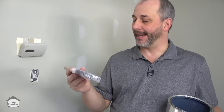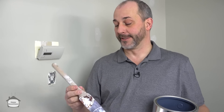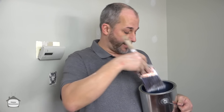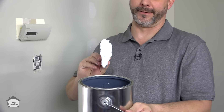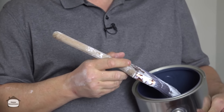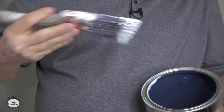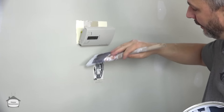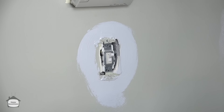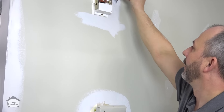This is a 3-inch brush from the Dulux store — about $13 or $15. Go to the professional store, ask for a regular 3-inch angle brush, pay a decent price and you'll get great results. Push it right into the bottom — now it's full of paint. That's a paintbrush loaded with too much paint — if you try painting with that you'll make a mess. Scrape off all four sides. Now the brush is still full of paint but it's clean. I want to paint with the paint from inside the brush. There's so much paint here — I can paint probably 15 to 20 linear feet of line with one brush load.